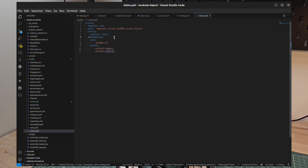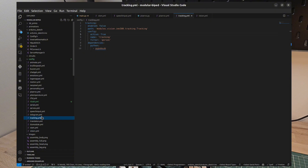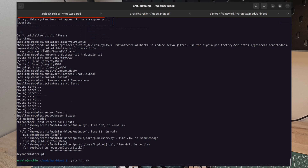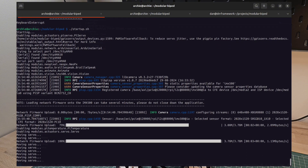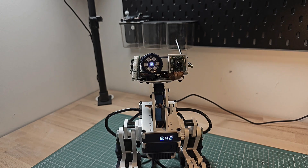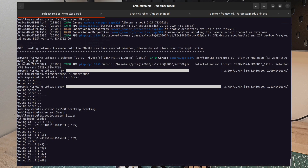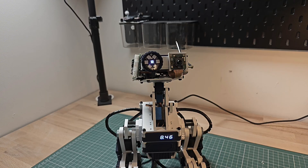More recently, I was sent the IMX500 AI camera from Raspberry Pi. What that allows me to do is send tracking information to a tracking module, which I can then use to follow me around the room. It's set up for basic object detection, and although you can't see where I'm sat, it's looking right at me as I'm talking into the camera. It will continue to track me because of the information being sent via the AI camera. The advantage of that camera over a standard CSI camera is that it takes the processing load off the Raspberry Pi to focus on all of the other modules it's currently running.